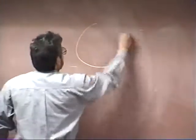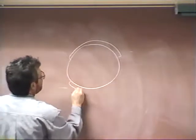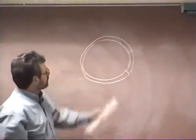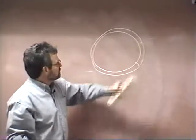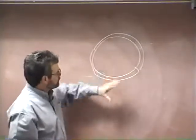The picture they're showing us there, you've got to remember, as you're coming down the side of that pipe, gravity is really giving you some problems. So you may have this pipe flushed out all of there, but it's not flushed out along these sides. So you may have to build it up a little bit more using these stripper passes. Basically you're going to come back, and I've had to do this several times. When you're welding that pipe, you come back and you pause a little more to add metal along that 2:30 to about 3:30 time, or 2 o'clock to 4 o'clock, whatever, along the side so that you build that up.